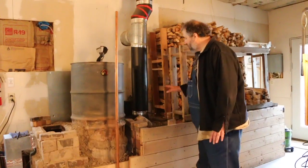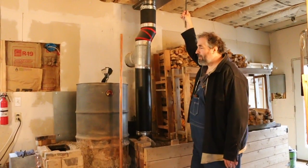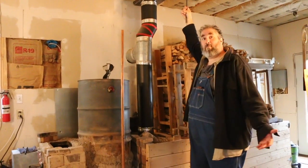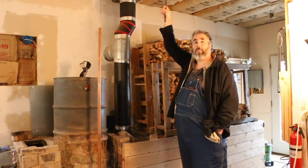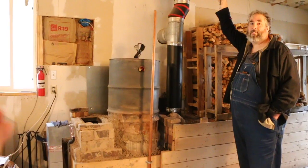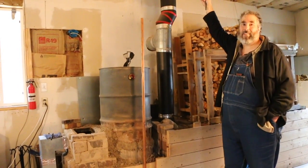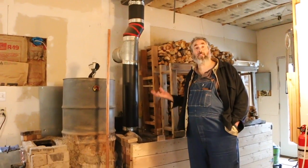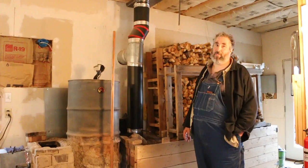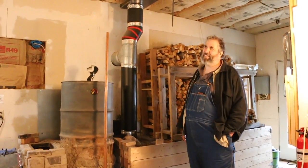So basically: don't build anything with a bypass, don't build anything with a guillotine on it, and don't build an external air intake. Keep it simple — and you'll have the best system. Even what we've got isn't that complicated; it's only as complicated as a normal wood stove with the same little knobs and whistles. The functionality of all this was to experiment, to find out and discover. We did the experiments, and what we learned is the simplest solution is the best solution. These things served a function and helped with tests, but in the end — nah, don't do what we did.